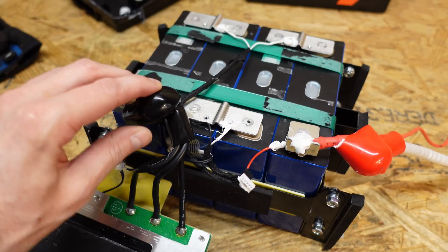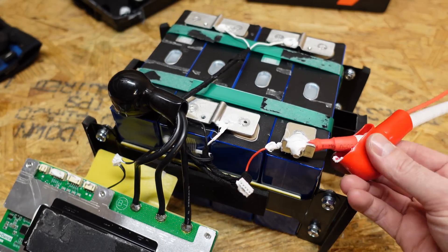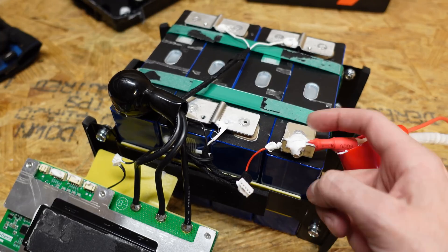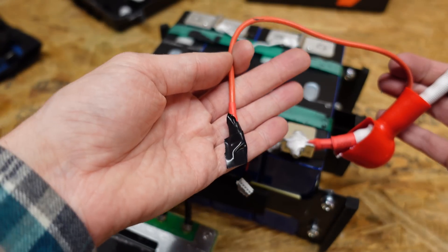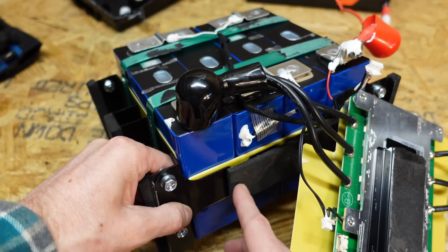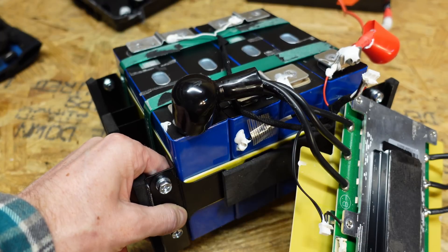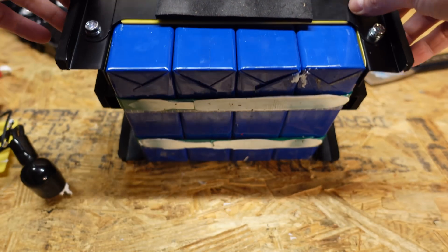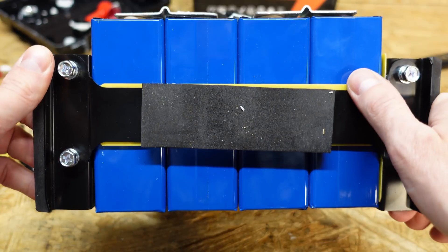On the other side of the battery pack we can see the main negative, with three conductors going onto the battery. The main positive has a threaded nut on the end and a screw holding the main negative lead, a separate lead going to the BMS for BMS power, and the positive for the balance lead. The temperature sensor is located directly on the side of the battery — a perfect placement. The cells all appear perfectly straight with no swelling or bloating, and no unnecessary gaps between them.